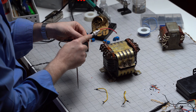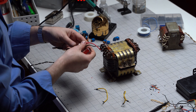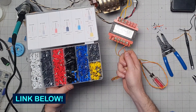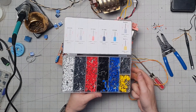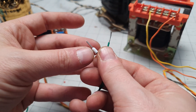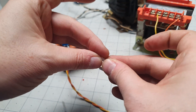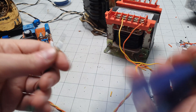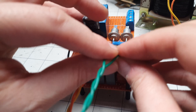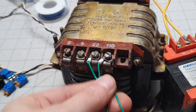I'm going to hook up these transformers. I've got a fuse in line here, so if there's any problem it's not just going to start melting insulation somewhere — hopefully that will keep us out of trouble. I started using these not too long ago — these are called wire crimping ferrules. Completely changed my game. Now I'm not putting stranded wire into screw terminals anymore. You find the smallest size that works, crimp it on, make sure it doesn't come off. All the wires stay nice and neat — no more orphan strands. They go right into our screw terminal, and the other end goes to our transformer. No stranded wires, nice and neat.